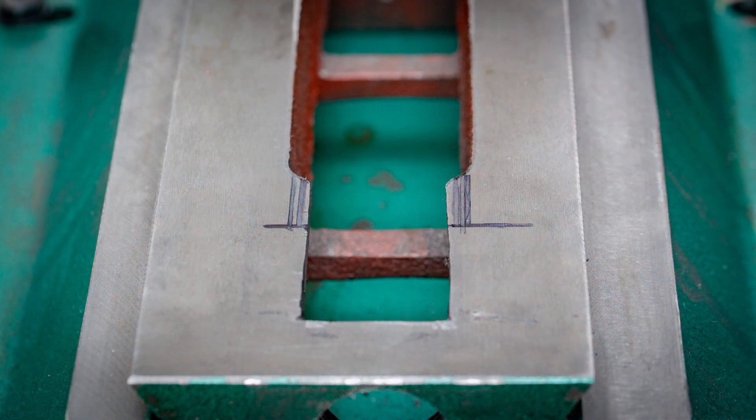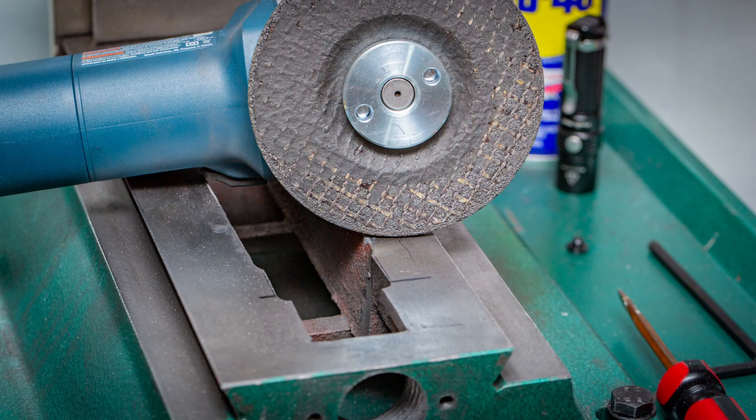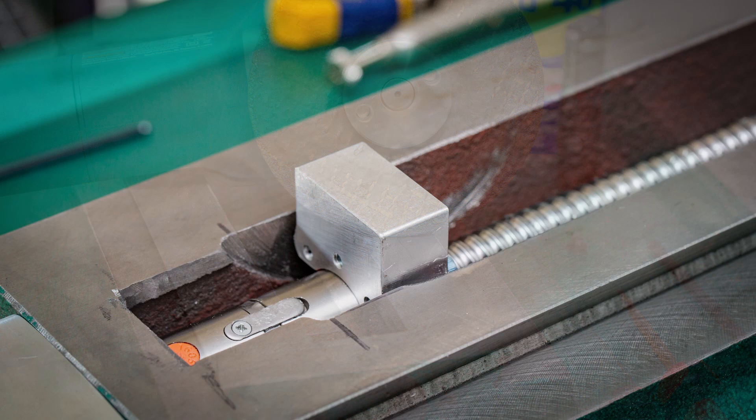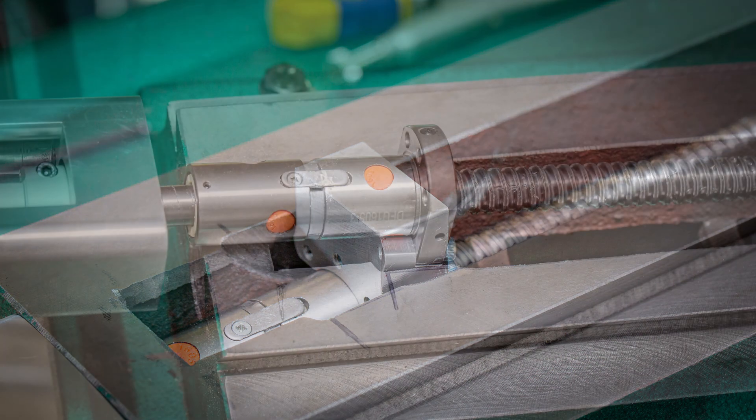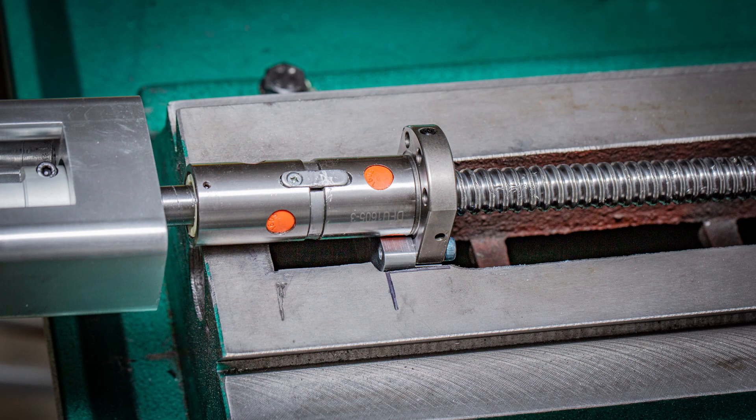Now that I could get the ball screw assembly into the casting I could see more clearly where I needed more clearance. I needed to open the slot on the top just a little bit wider, so for this task I used a four and a half inch angle grinder. Here you can see where the ball nut assembly moves into the little bit wider section of the slot. I probably could have left the front inch and a half of the casting in place but I don't think it'll hurt anything. Here's what it looks like with the ball nut at the full Y negative limit of travel — you can see where the end of the ball nut is going to protrude into that new inch and a quarter hole.